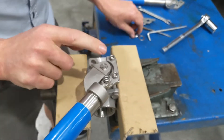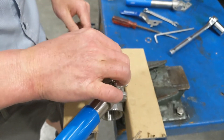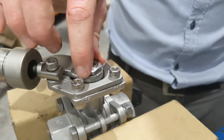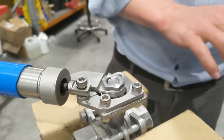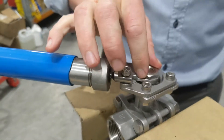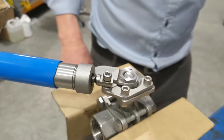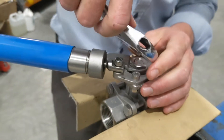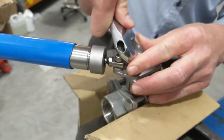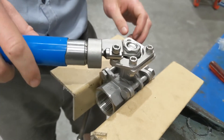The last thing we're going to do — and sometimes this isn't possible depending on the shaft height — is put the retaining nut back on top. We might get just a couple of turns on that one. It's finger tight, just nipped up, which is okay for this one. We don't want to overtighten it as it might start pushing down on the Belleville washers underneath.